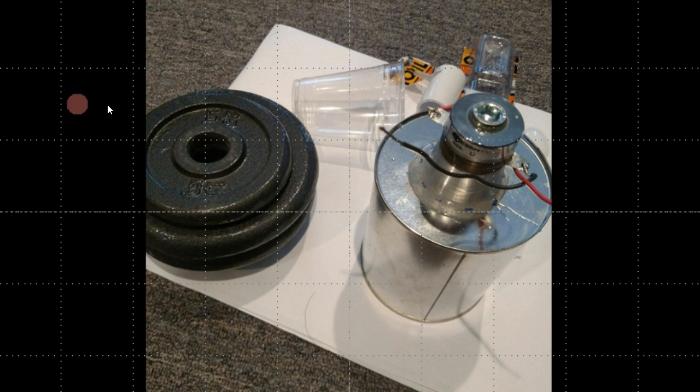I want to bring your attention to this figure here. We have our transducer, and we should already have soldered wires to it. For the middle electrode, you solder a red wire; for the other electrode, you solder a black wire. This is very important because the black wire is attached to ground through the screw and the metal top part. It goes through and attaches to ground through the base and then through the cup. So you can remain electrically safe if you attach the ground to that side and not the live wire.